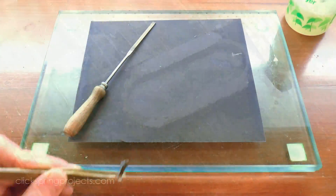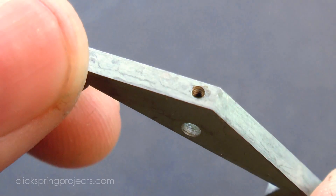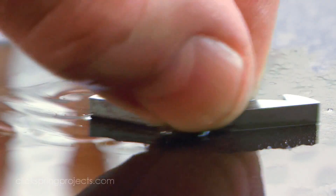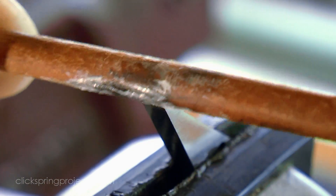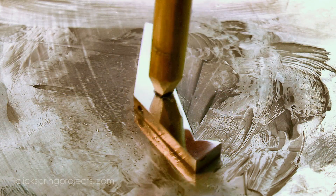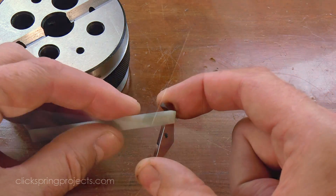Boiling water dissolves the hard glaze, and the pallets are ready for polishing. I'm not tempering the part at all prior to polishing — it's recommended that escapement pallets are left glass hard to maximise their service life. It's also important that the pallet faces in particular have a highly polished surface to minimise friction with the escape wheel teeth. So I put in a fair amount of time to get all surfaces to a high polish, starting with abrasive paper, and then finishing with diamantine powder on both a wood polisher and tin lap. All pallet surfaces now have the required finish, and I used a fine oil stone to break the sharp corners and leave a presentable edge.